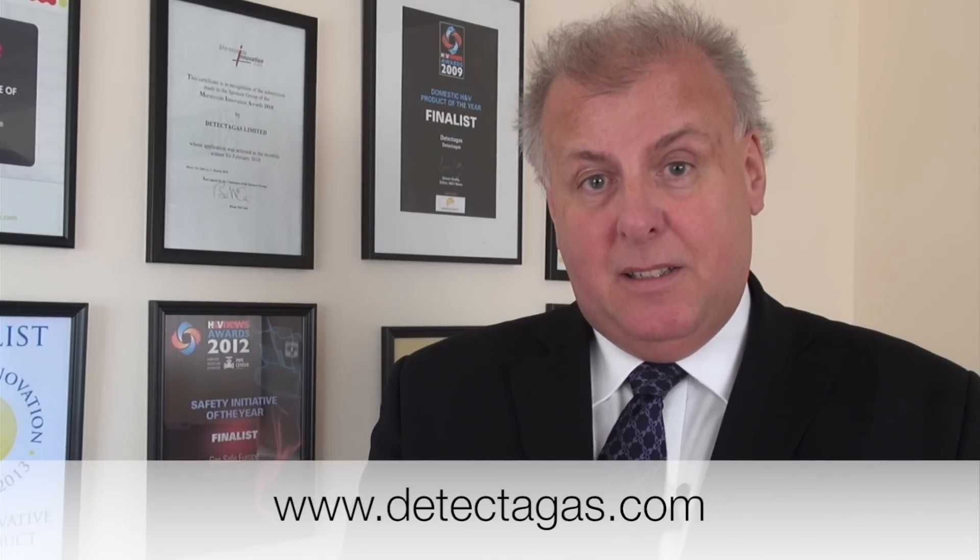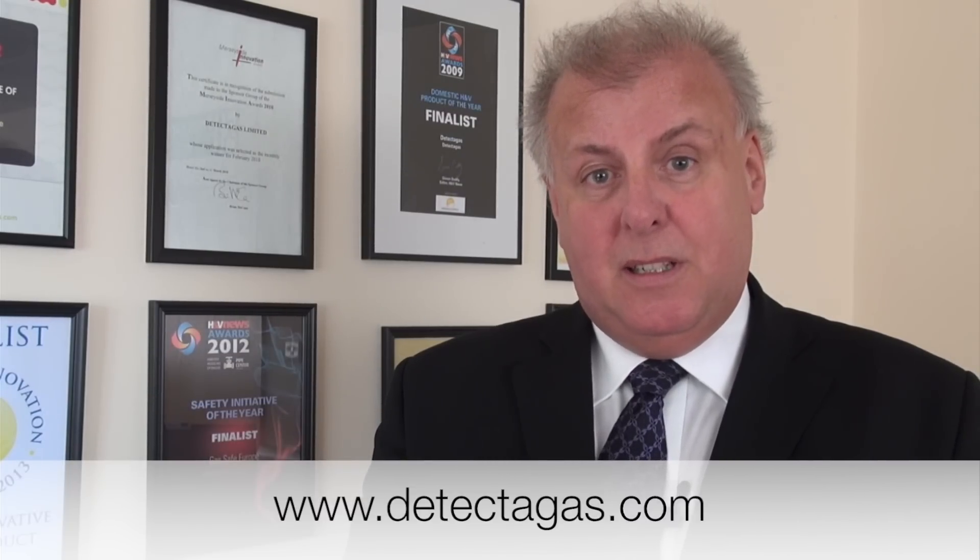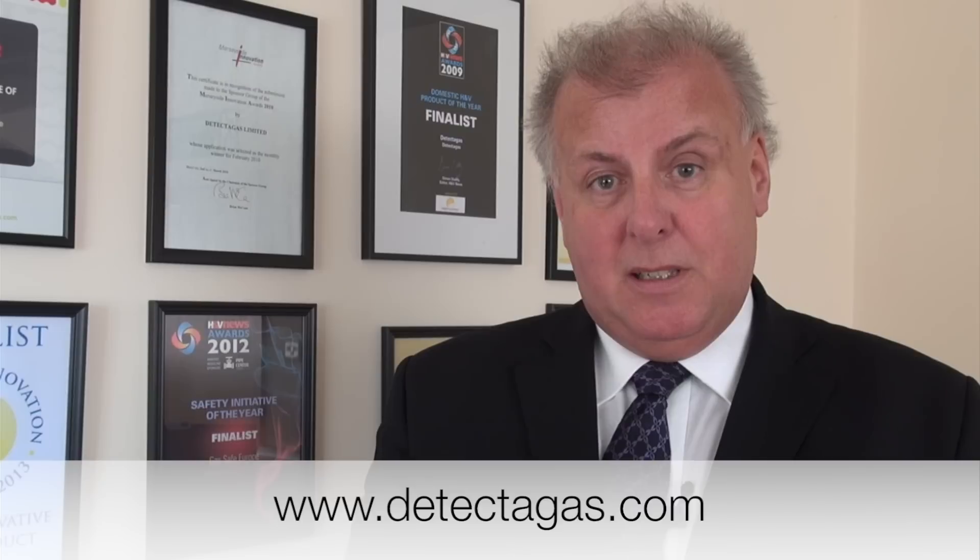Some CO alarms have now been given a 10 year warranty. Typically the warranty is around 7 years. So if you find that your CO alarm is not working within warranty, you should be able to take it back to the retailer or manufacturer and ask for a replacement. If there is any doubt at all, you should replace your CO alarm. Test it on installation and test it annually thereafter to make sure that it is still sensing carbon monoxide gas.